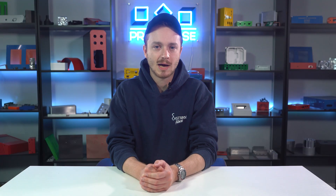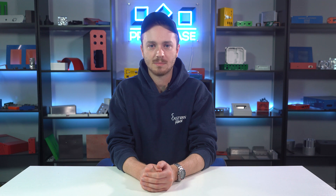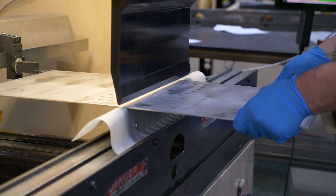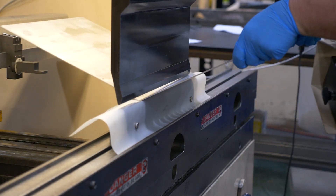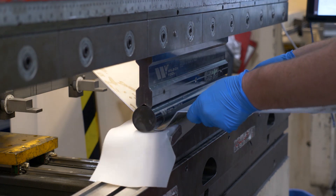Finally, we have W-bends, which is our newest specialty type of bending at Protocase. W-bending, also known as backbending, is a technique used to form deep U-shaped profiles without the need for specialized tooling. W-bending replaces the need to have two separate parts that are welded together to create the deep U-shaped profile. The process works by forming a slight bend in the middle of your part, then bending the sides to create a W-shape, and finally flattening out the middle.